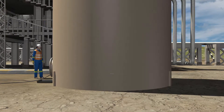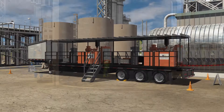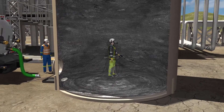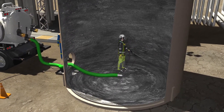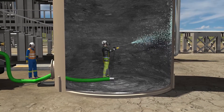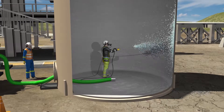Alternatively, the cleaning team enters the tank with a high-pressure steam hose that is connected to either a high-pressure wash unit or chemical cleaning truck. The cleaning team also enters the tank carrying the vacuum truck hose, which is positioned on the floor of the tank so that debris and sludge can be washed towards it. The pump on the chosen unit is turned on and the crew member inside the tank maneuvers the wash gun until all sludge is sucked out and interior walls are cleaned.